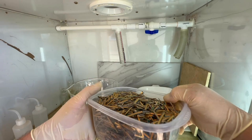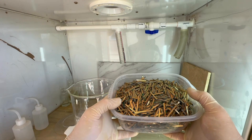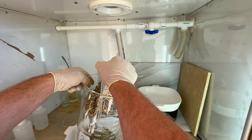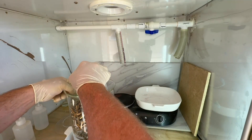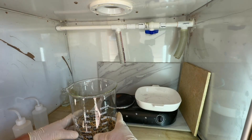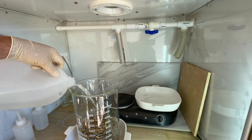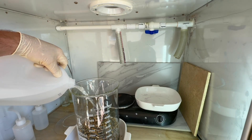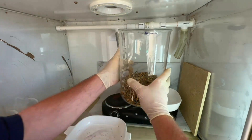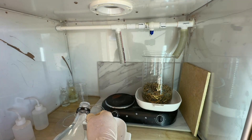Welcome to my channel Acids and Gases. Today I've got 1318 grams of trimmed RAM fingers to process. I'm going to get them into the beaker using the method where we don't separate the foils from the fingers — once we remove the base metals, we go directly to aqua regia to get a better idea of how that works versus a smaller experiment I did a few videos ago. I'll put in some distilled water and measure out about 600 milliliters of nitric acid to start.